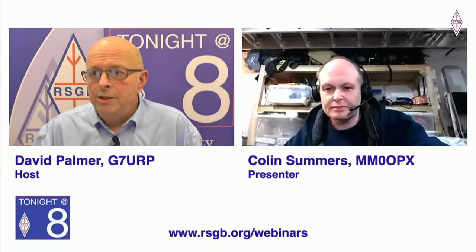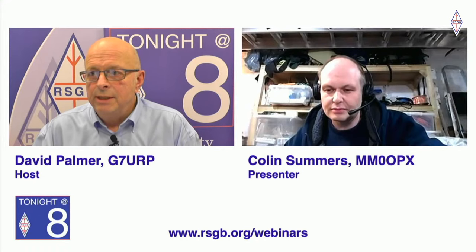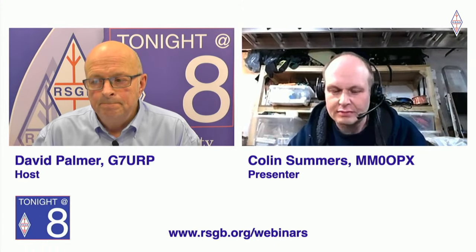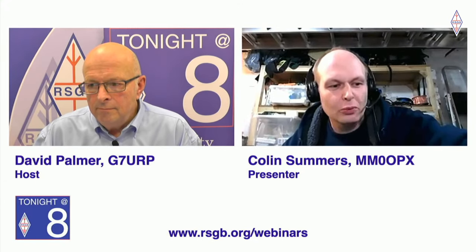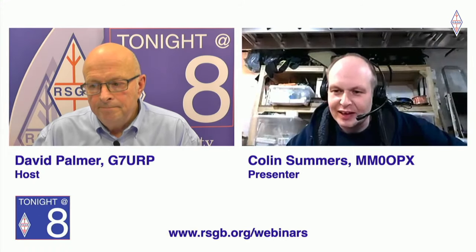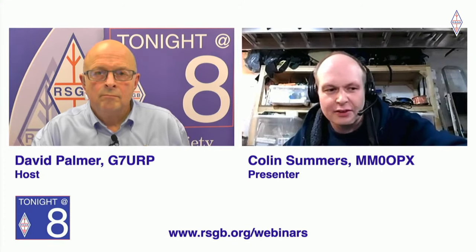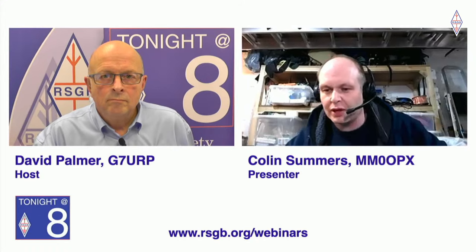Yes, and in fact, G0FVT came back to Ian as well and just said that he reckons to continue the same way, but the crossover is there to reduce the effects of end capacitance, which must make a difference as well. Yep. As I say, this is where it almost gets me a little bit stuck because I have an electronics background here, but that's certainly how I understand it, and I think that's also part of what the capacitor does.